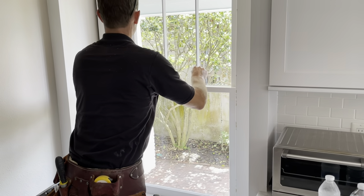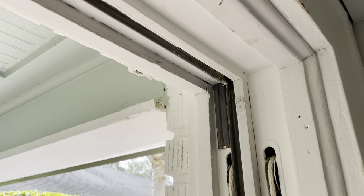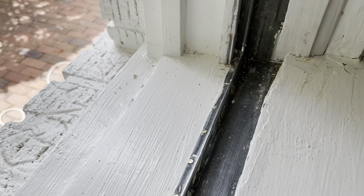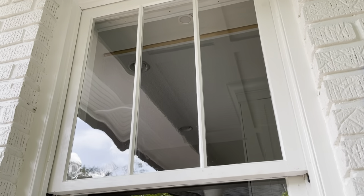This is really excellent weatherstripping — I'd recommend keeping it if you have it. Windows operate very well and they're very airtight. That's what it should look like once it's reinstalled and restored. You'll be good for another hundred years with this weatherstripping — it really does last. There are bronze versions for coastal regions and zinc versions in areas not on the coast. No difference in how you deal with each other than making sure you're using a compatible nail for the weatherstrip. I typically use zinc nails, but they had brass nails so we went back with that. You'll see just a little bit of it peeking out — don't paint that, leave it as is. It's a sign that you've got a well-weatherstripped window.